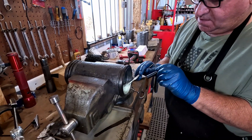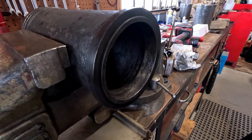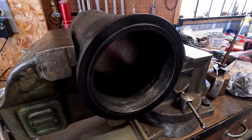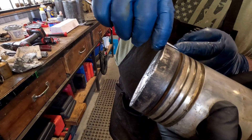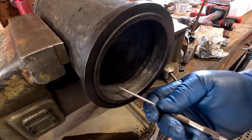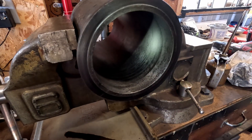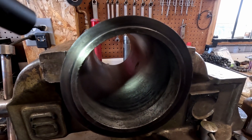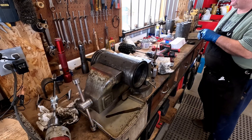The last ring is right there and we're not feeling anything in there. I think we've got decent cross-hatching - from here to there, at least an inch. There was a groove there that's not in there anymore, it's smooth. What do you think? I think we've got decent cross-hatching in there. I think we're good.